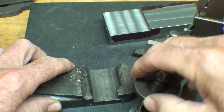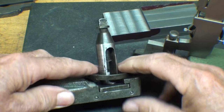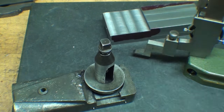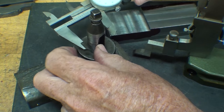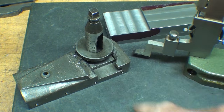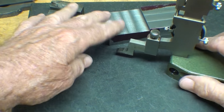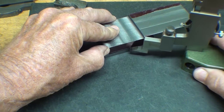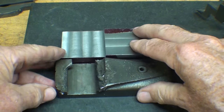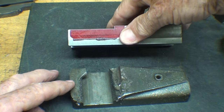This is so bunged up it's really hard to get a measurement off of it. The tool post itself is about 3/4 inch in diameter, so I'll use a 3/4 end mill to make the initial slot, and I'll take the depth right off of this and transfer it over to the new piece. Then I need to locate the T-slot on here simply by taking it off of this, so let me do that off camera.